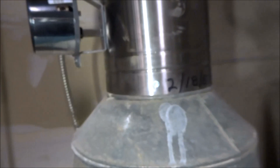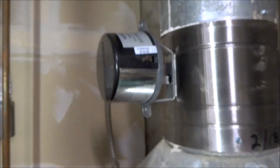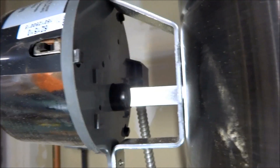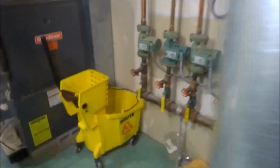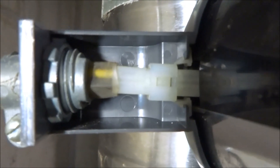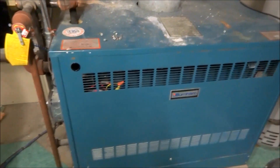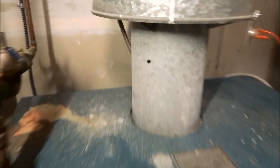We're good — got the date right on it. It's a Field. Like I said, you can use that bypass if you have to. But what happens with a lot of these is the end switch gets stuck. It's right in the molex plug — I think there's a little flat spot on the bottom there. That's it. Put the cover back on. I probably should have put the cover on when I did the combustion test, but it's good. I cleaned all the burners — the burners are all clean.